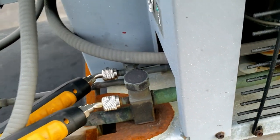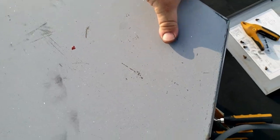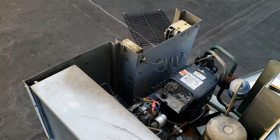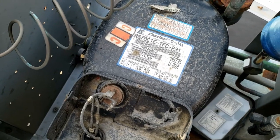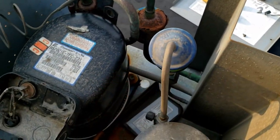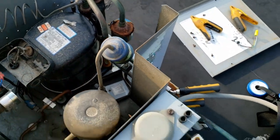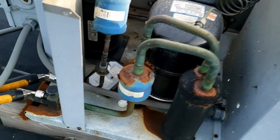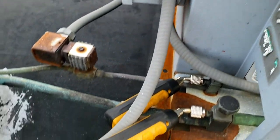It looks cool though. Running POE oil, so we're either running R404A or R134a. The discharge is hot, so we obviously have something in there — it just looks really low. That sight glass is probably just so empty that it's not showing up.